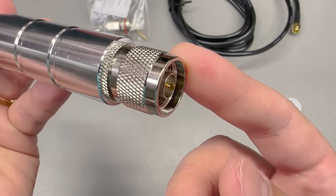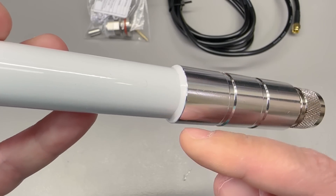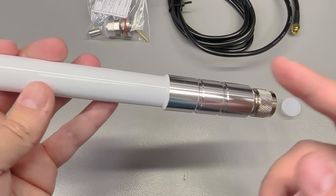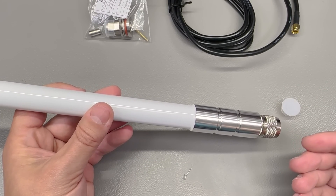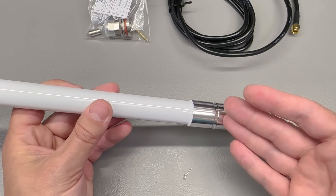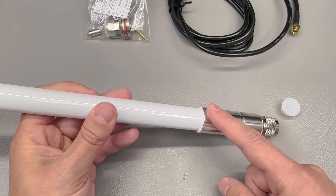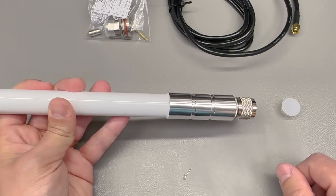The build quality feels pretty nice — the ends are sealed with silicone and there's a strong metal base which can be used for mechanically attaching this to a post. I plan to use my NanoVNA to do some measurements on this antenna to test for its center frequency and SWR and compare it with other options, so there will be a future video on this topic. Whenever I receive antennas I like to put a label or write on it with a marker to have the center frequency and part number available for future reference.